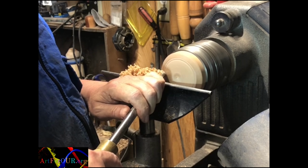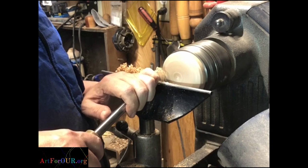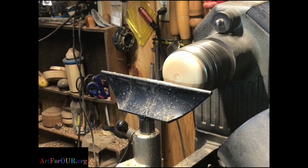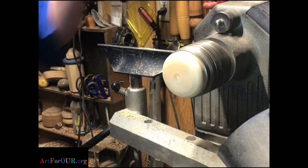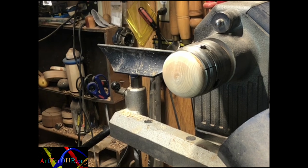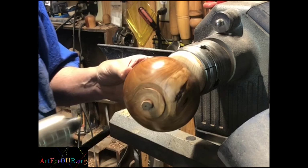So I'll smooth out this little jam chuck, and you'll see I'll put the bowl over that and push my tailstock up against the tenon here in just a moment. There you can see the jam chuck has just been smoothed over. I'm going to pick up a piece of non-slip cloth. This is like a drawer liner. Put it inside the bowl.